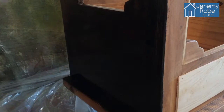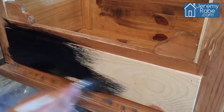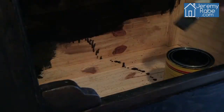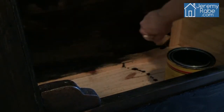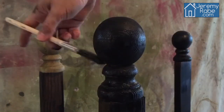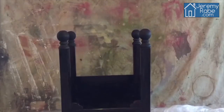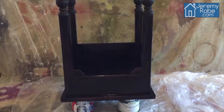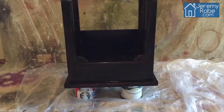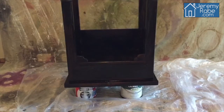I'm gonna be using an ebony stain for a dark, rich look. You might need one coat, maybe two, depending on your personal preference. Don't forget to seal it after you're done staining. When I stained this table, I propped it up on old paint cans so that the stain won't puddle at the bottom and it will give it an even finished look on the bottom edge.